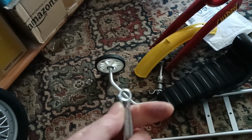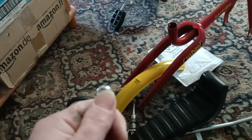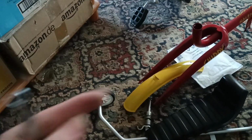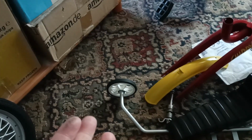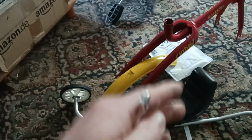Now with the bolts, I'm going to have to put a bolt in there, which is going to be interesting, and a bolt in that hole, which is also going to be interesting. And I've got this tiny, tiny spanner. Now, I would use a magnet to hold the nut in place, but because it's in a metal frame, I'm worried if it goes wrong, the magnet's going to be stuck in there. So I'm going to put some tape across that to hold the nut into the spanner, and then that should hold it in while I feed the bolt through from the other side. That's the theory. So I'm going to do that off camera because that's going to take me, Lord alone knows how long, just to get the nuts and bolts to fit, and then the two halves can go together, and then we'll see where we are from there.